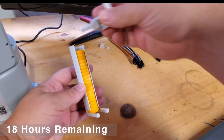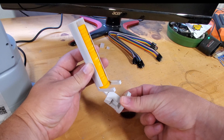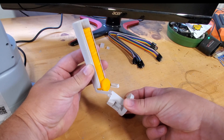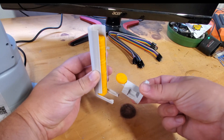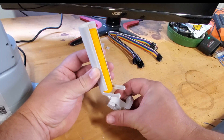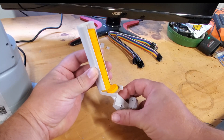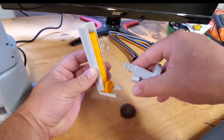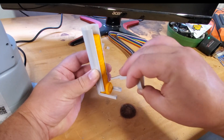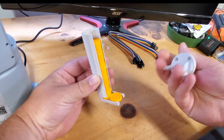Always make sure the area around your robot is clear and you know what it's going to do. I made this design for the arm to get the little coins — you'd have a dispenser mounted somewhere with a little servo on top to hold a coin in place. The problem is that when the robot slides the coin out, once it gets far enough out there's nothing underneath to stop the whole tower from flipping it, making it inconsistent where the coin lands. So unfortunately, this is not going to work.